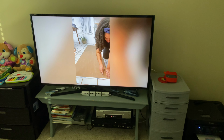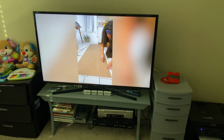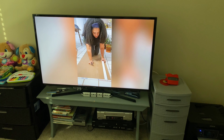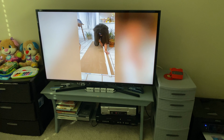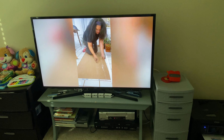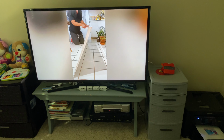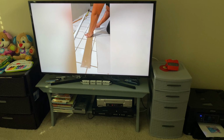This was my first time working with drywall for an arch, and it was a lot more challenging than I thought it would be. I cut out the drywall, scored it with a straight edge, and then once you have it scored, you can bend it and snap it. To bend and snap it, you really need to have it free, so I used a drywall knife to cut it down first, and then I scored the drywall for underneath the arch.